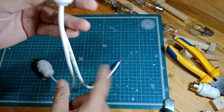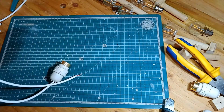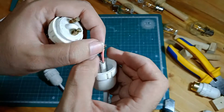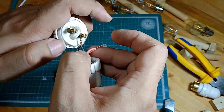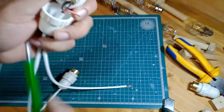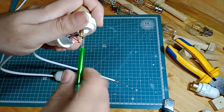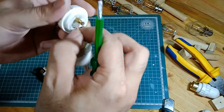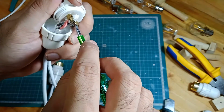So now these two wires are connected, but you also need to give a connection to the bulb output here. So that's where this will come in. Now since the wires are quite thick, because there are two thicknesses of these conductors, I don't need to fold the insulation over to get some purchase on this. I can simply put the copper cable inside and tighten this down. You don't need to over tighten these. You may strip the threads, and this one goes in.